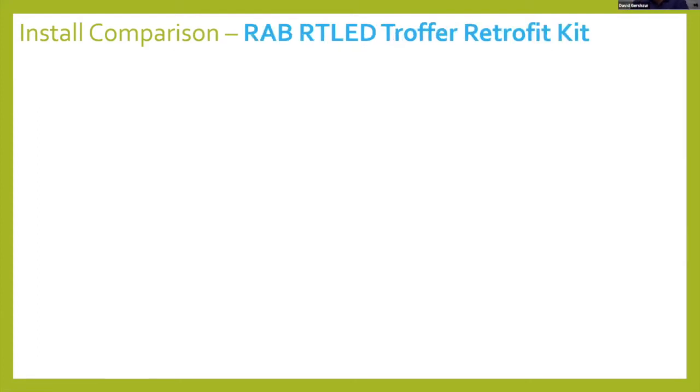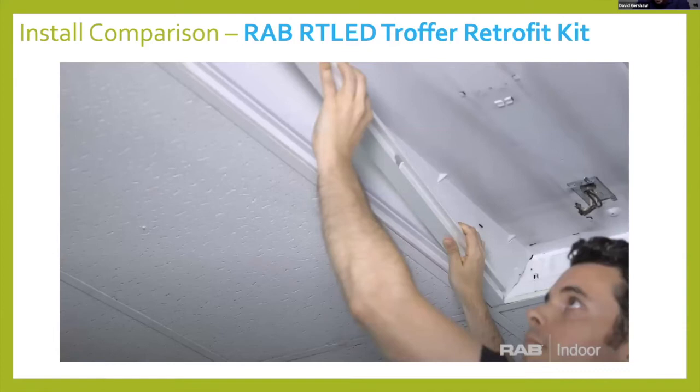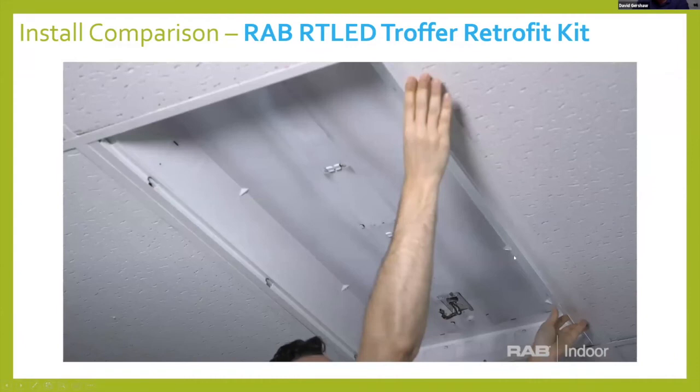Let's look at the RAB. RAB calls theirs the RT LED Troffer Retrofit Kit. So step 1, you can see there's this bracket piece. See that right here? That's going to slide in between the T-bar grid and that old fixture. So step 1 is putting that on one side. So it's already inserted there. Step 2 is to do that on the other side.